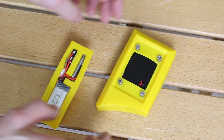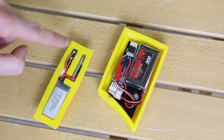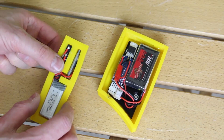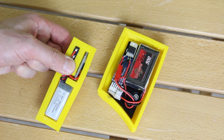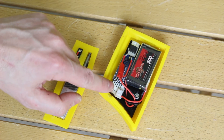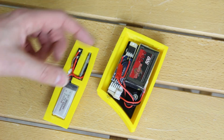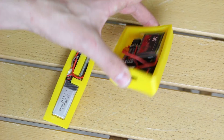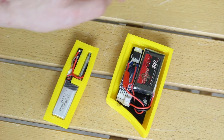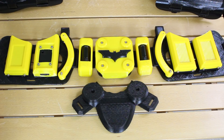What we've got in those modules is: each one has a 7.4 volt LiPo, a 5 volt regulator, and a little Bluetooth board — a bit shoehorned in that one, but everything fits. This one has a little switch which powers it up, so squashing it powers up the Bluetooth module and it pairs with the other one. These Bluetooth modules have a state pin which changes state when they're paired, so even without an Arduino and no actual data changing, I can tell when they're paired. This module detaches from the belt altogether and can be clipped onto another accessory, so I can make sure it doesn't turn on until I press my back gauntlet — it could be used to start the backboard or something else.